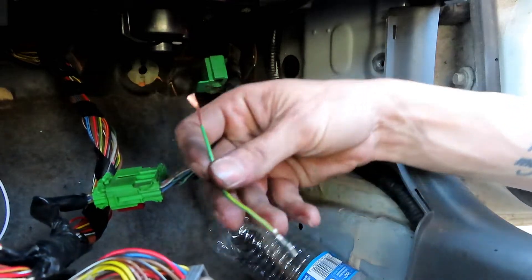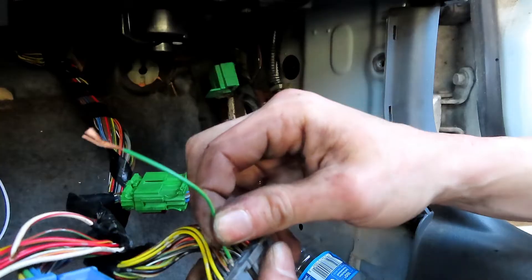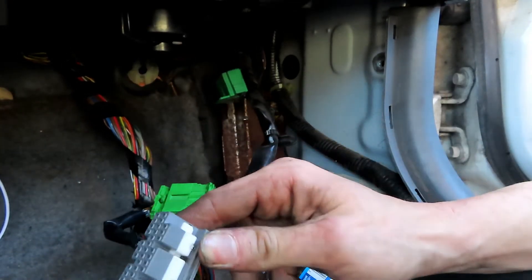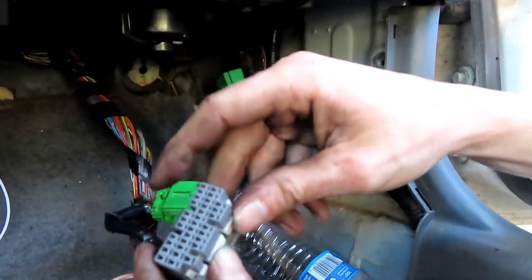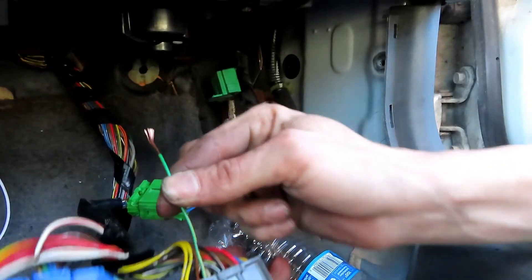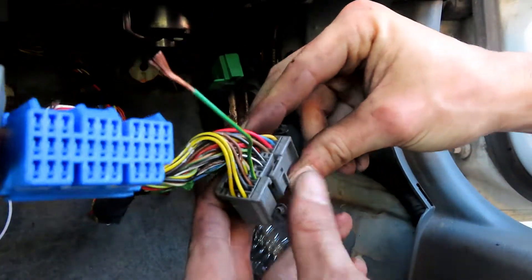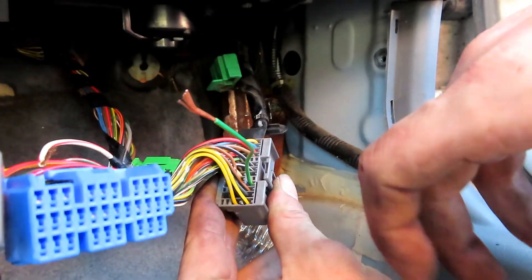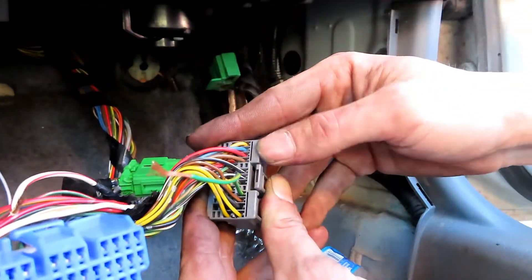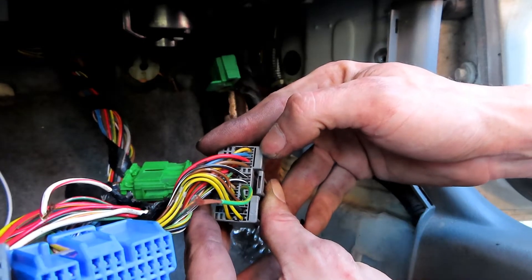Going in is extremely easy - you literally just put it in and it just clips right in. Once you're done, go ahead and push on this again. Now that that's in place, that wire ain't going nowhere anytime soon. Just as a quick reminder: this is going to be A8. For an OBD2 car it's going to be A8. The easiest way to know is on the opposite side are your injectors, and they're going to be solid colors - green, blue...